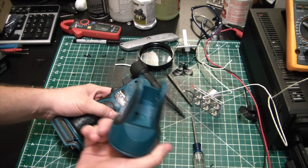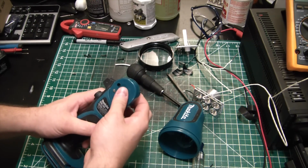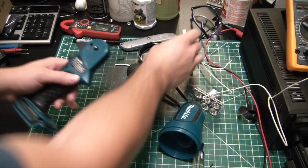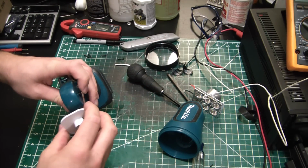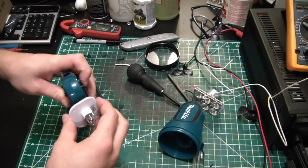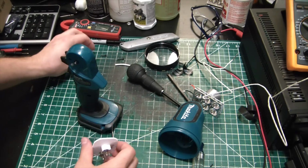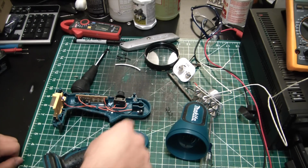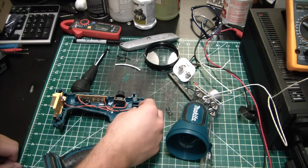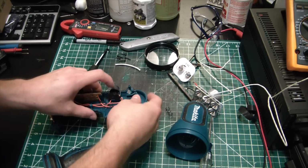This thing just kind of yanks off. And here's our electrical contacts. So the wires on each side, well, not wires, but contacts, are touching this as they rotate. That makes it a little more challenging, but so my thought is to basically eliminate these contacts and just run a stranded wire straight up through her.